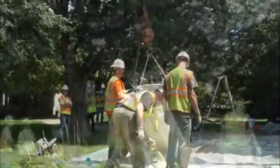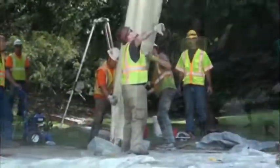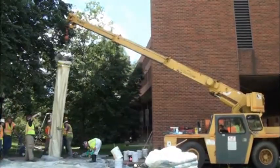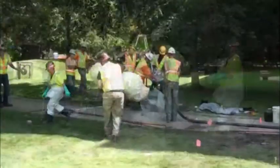This gets lowered into the manhole carefully so you don't get the epoxy resin all over the frame of the manhole. Then they use air to inflate the bladder that's inside and push it against the wall of the manhole using under 10 psi of pressure.